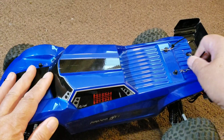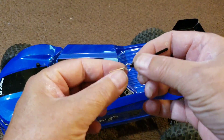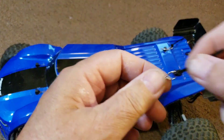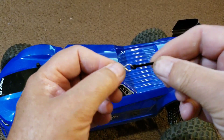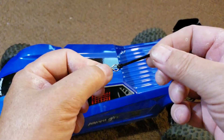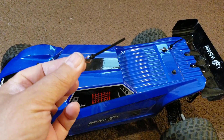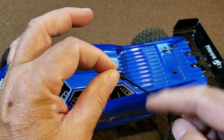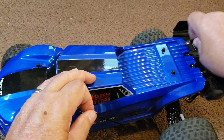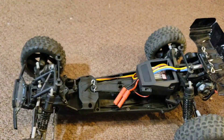Let's get these last two pins out. Now this is nothing I invented — I've seen others do this — but with these small pins and large fingers it can sometimes be fidgety. What I did is use a wire wrap, or zip tie, some people call them. It kind of gives you a little extra tail, makes it easier to pull these out and put them in, and easier to keep track of them.